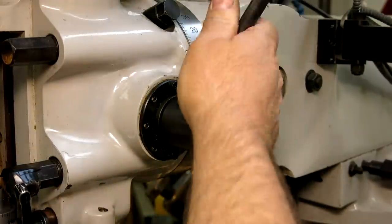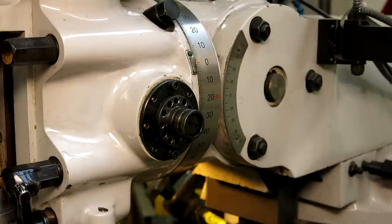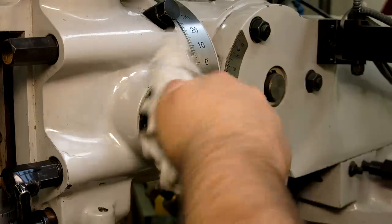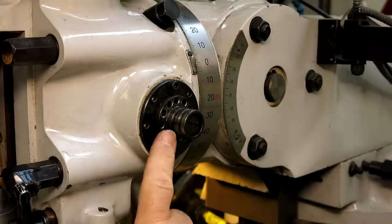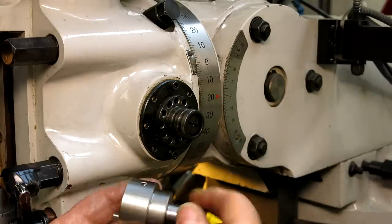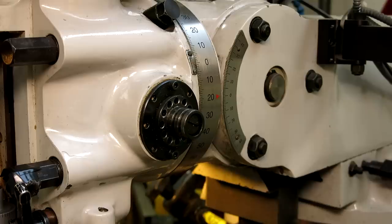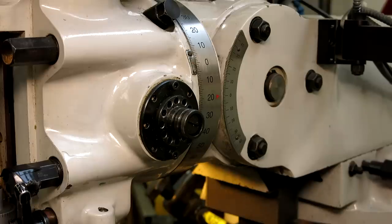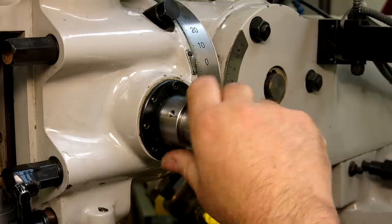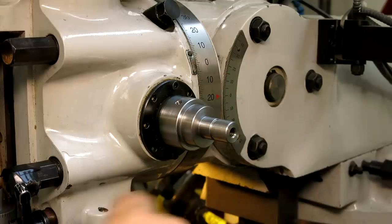All right, let's see how we did there. This is what we're adapting to here, and you can see the drive pins in that, and then that set screw that I put in the side there is just a retaining screw. It was half inch. Yeah, so it holds it. The set screw kind of goes in that groove there. It just keeps it from falling off, right? All right, looks like we're fine. We're almost there. Cool. So I think we're ready.